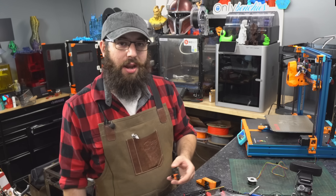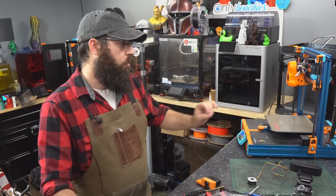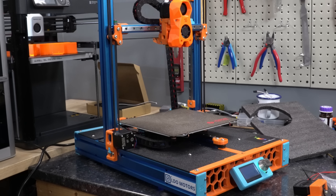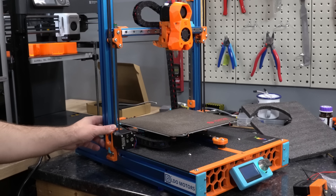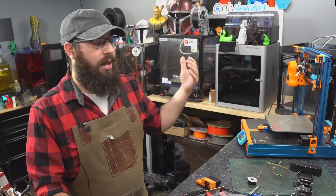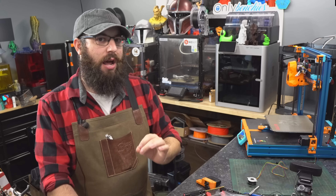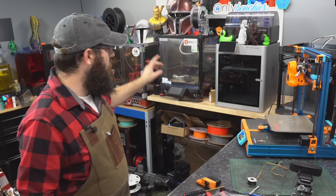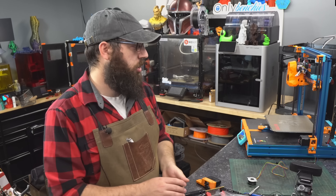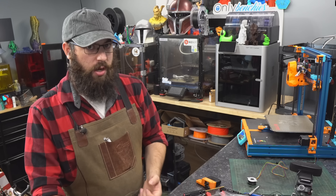That's how I have this system set up on my Switchwire, and it's working great. Now there are a few caveats to keep in mind. With my Switchwire, with the stepper motors I have specced for it and the weight of the gantry, even though the brakes engage on both motors, sometimes my gantry does sag ever so slightly. It's not dropping to the ground, but over the course of 10 or 15 minutes it slowly sags down until it touches the bed. I'm attributing that to the weight — with this toolhead and LGX combination, it barely does not have enough holding torque, even with the brake applied. On a system like my Voron V2 or my belted V0, it would hold up perfectly. So if you try this and find your stepper motors with the brakes are not enough, you may need bigger stepper motors for more inherent braking power.